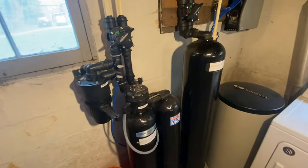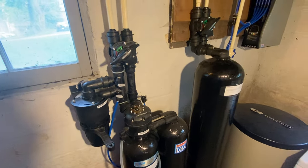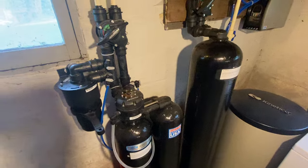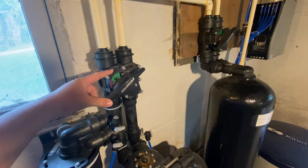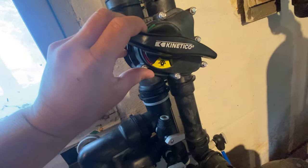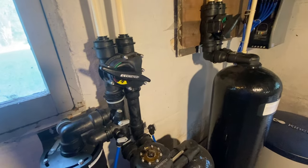This time I'm going to show you how to change your Kinetico whole house pre-filter while getting as little water on the floor as possible, because a lot of times these units are installed in closets of mobile homes or maybe in a finished portion of the basement and you don't want to get the floor all wet. First things first, come up to your bypass and turn it to the seven o'clock position. You will see yellow pop up — just make sure that window is full of yellow. You can turn it either way; it really doesn't matter, it just depends on how the unit is plumbed in your home.